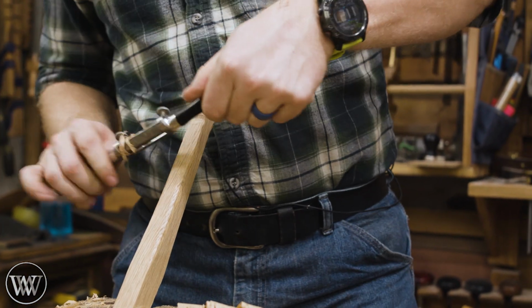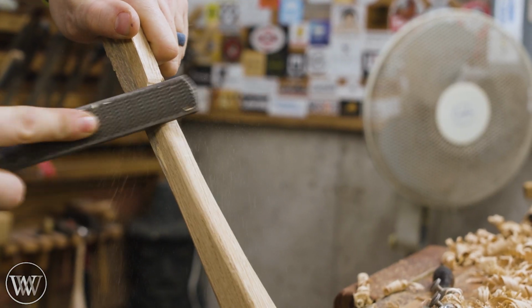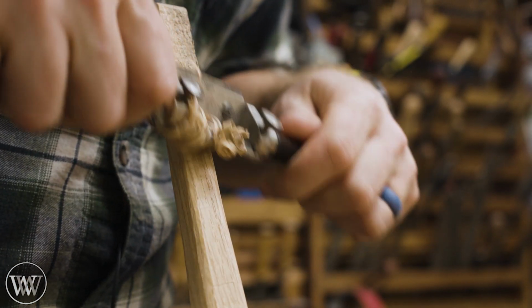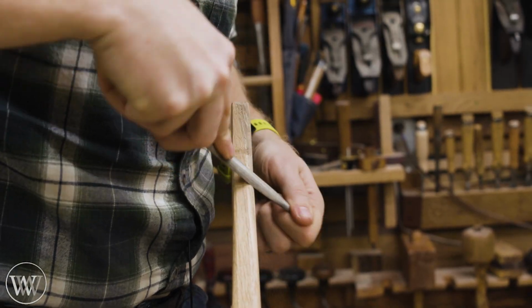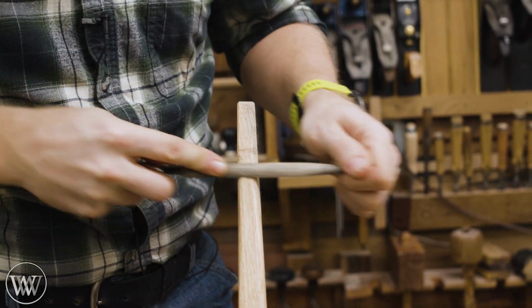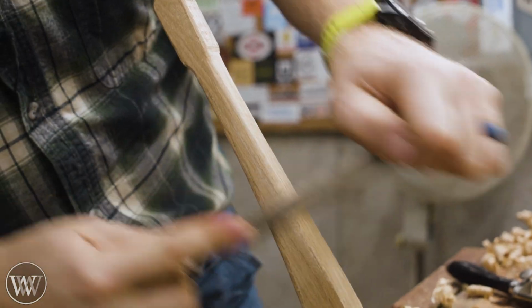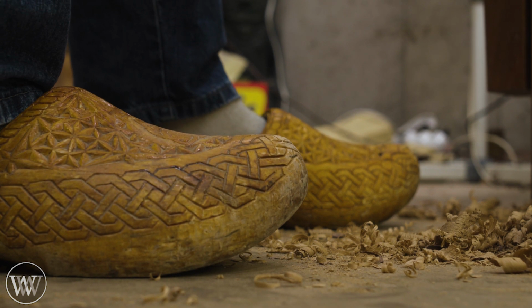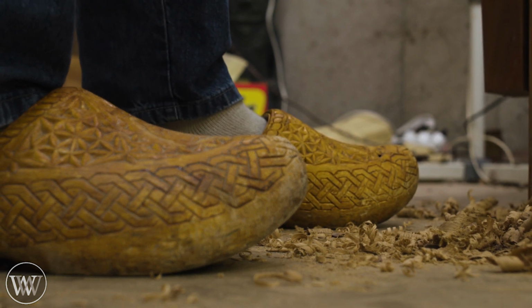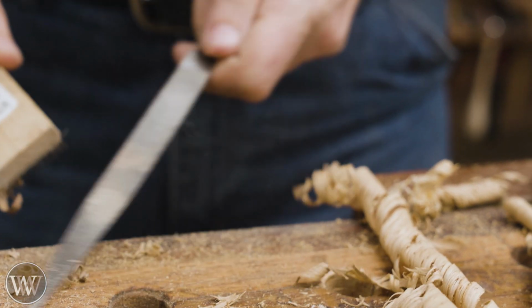For all of the corners and edges on this, I'm actually going to be doing a heavy roundover on it. Where it's tight up into that shoulder, I have to use rounded rat's tail rasps, and then for the main shaft, I can then clean it up with a spoke shave, and then get rid of the facets from the spoke shave with a file, using a little bit of a draw knife function, as well as running across the board will clean it out.